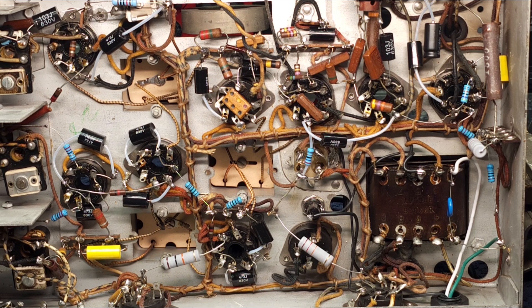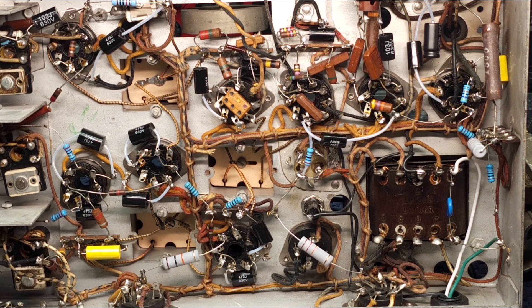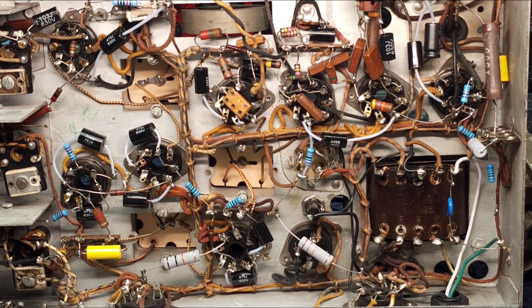At this point, this radio is electronically rebuilt. Normally at this stage I'd flip it over, put tubes in, and turn it on to see if we've got a radio. But if you remember from the initial assessment video, the main tuning capacitor is loose and slopping all over the upper deck, and the grommets are bad. So I'm going to do something different there, and also get the dial window back centered with the front faceplate.